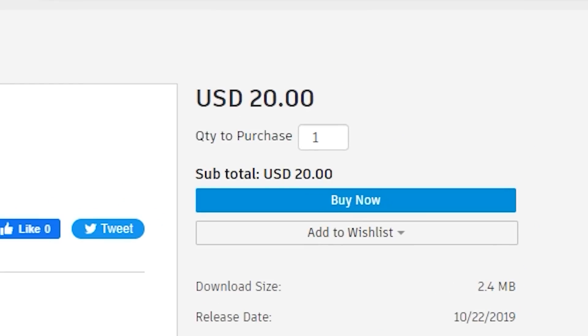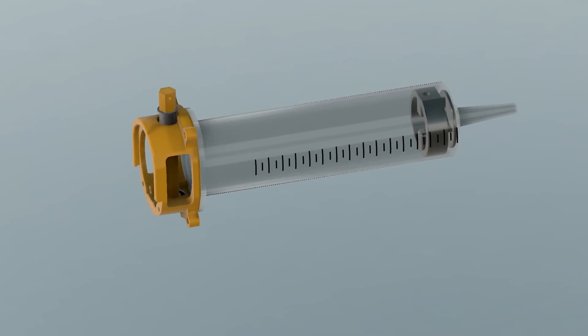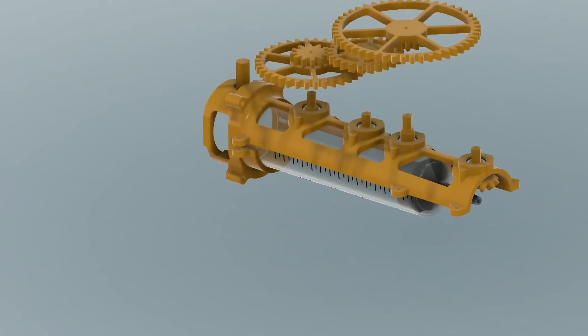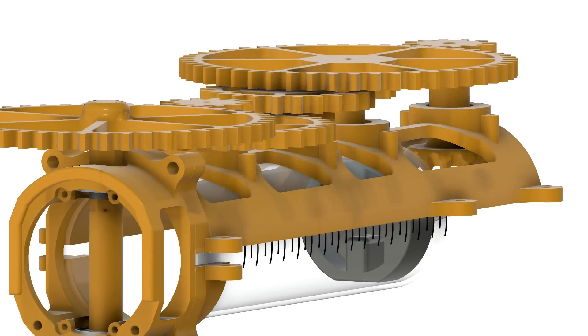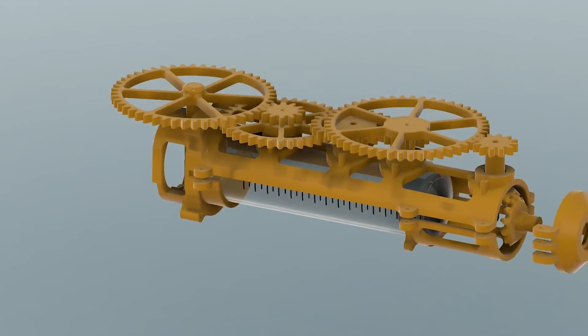I've literally been looking at gear theory for the last two days to try and design these bevel gears from scratch, and I've got precisely nothing. I did find a plugin, but it was $20. I did finally find a way to design a bevel gear by slightly modifying a spur gear. So now I've figured out how to design a bevel gear, I designed the rest of the gearing system around this. The syringe piston will be attached to a reel by some string, so that as atmospheric pressure forces the piston down the syringe, it causes the reel to rotate as it unwinds. The shaft of the reel is attached to a geartrain which increases rotational speed at each step at the expense of decreased torque. This geartrain has a ratio of 1 to 96, so for every one rotation of the reel, the propeller will rotate 96 times. The bevel gears then convert the rotational motion 90 degrees to drive the propeller in the correct direction. So now I just need to print it off and put it all together.